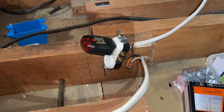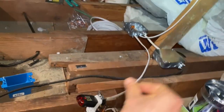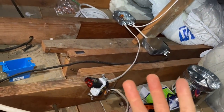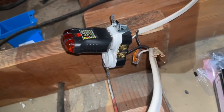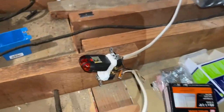I'm piggybacking off it to a standard wall outlet that you can buy at a hardware store. These white cables are called Romex and they have three wires inside: a white, a black, and a bare copper wire — the ground wire. Inside these outlets you'll have brass screws on one side, and on the other side silver screws — that's where the white wires will go.